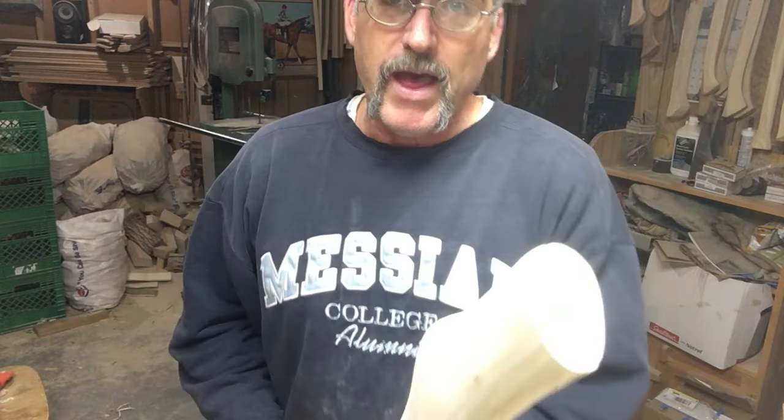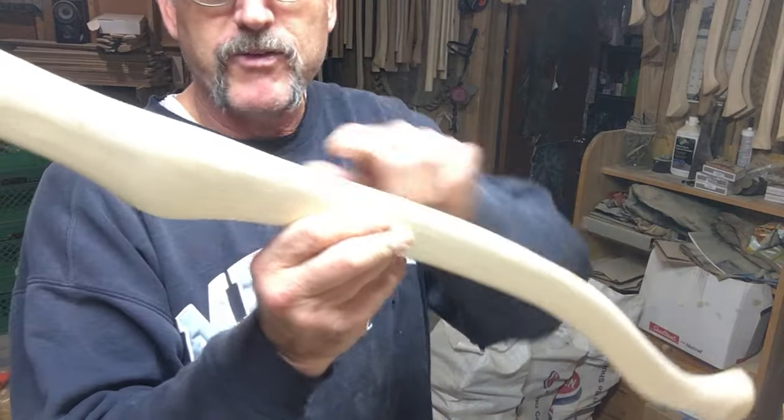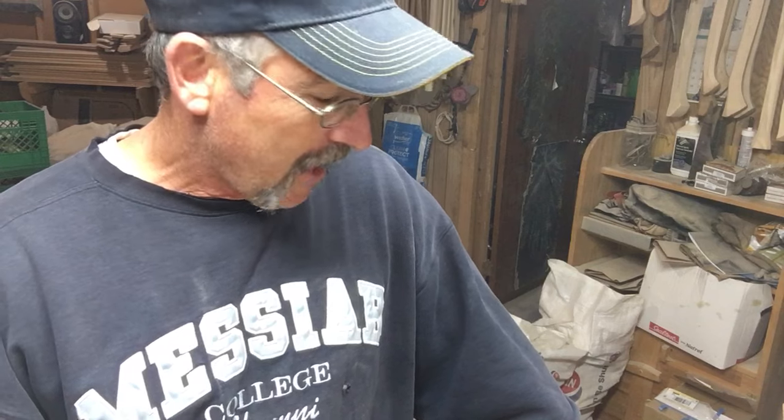The problem with that big shoulder is that as the head keeps going down, it curls again — that's why all of our racing axe handles are continuous. With this big sweep, every time I take it off and nudge it down a little farther it's going to curl again. That's the disadvantage of having these big shoulders. I'll smooth that out as best I can, but I can't be as aggressive. I was going to wedge it but I don't want to hang it for him — he wants the handle out. That's it, it's finished, nice and smooth the whole way around. He'll tap it on, put a wedge in to take up the slack, and it's good to go. That's called a proud hang when it hangs up through there, and some guys will cut it off and smooth up the top. So that is an axe handle start to finish — a custom handle, three parts. I'll finish the other two handles, then these are headed to Quebec City for Emmanuel Belanger. He's going to be selling these new axe heads and handles. Watch the East Coast Lumberjack channel — coming up, we'll talk about how to store your axes and we'll talk about WD-40 versus Crown — there's a big difference, and for anybody that has an axe they value you'll want to tune in. Subscribe to be sure you get that as soon as it comes out. East Coast Lumberjack signing off.